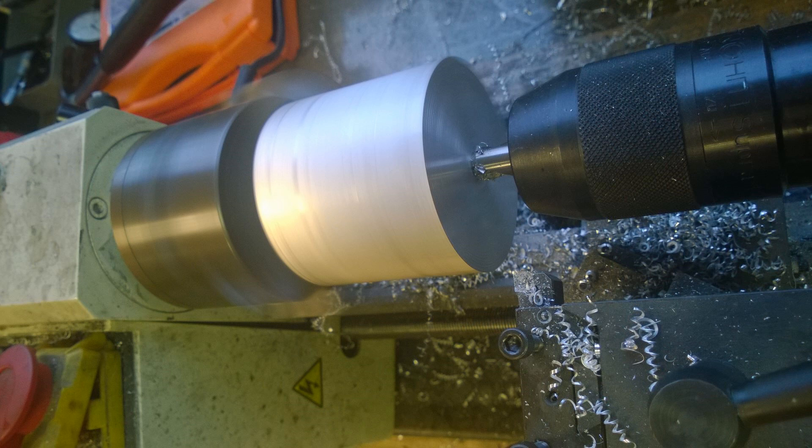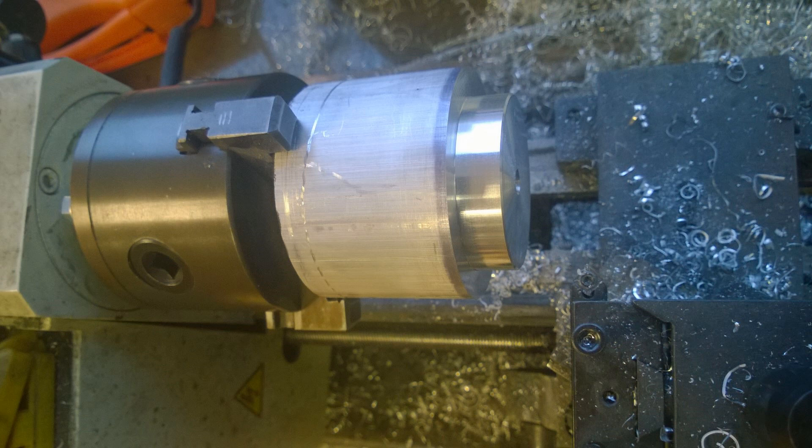Right, this is part five — we are making the cylinder. I've lobbed off a piece of that 70mm aluminum billet and I'm center drilling it so I can put a center in it and turn between centers. One of the first things I do is machine the base of the cylinder. This is the cooler part of the cylinder, so it doesn't need coolant fins. It also means I can machine a smaller OD and then flip it around and hold it properly.